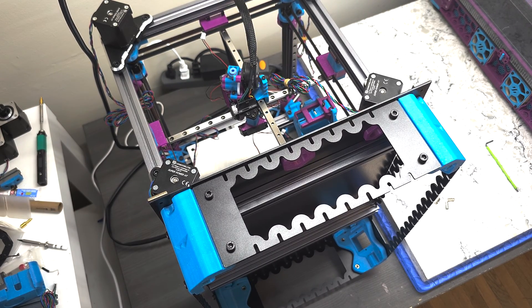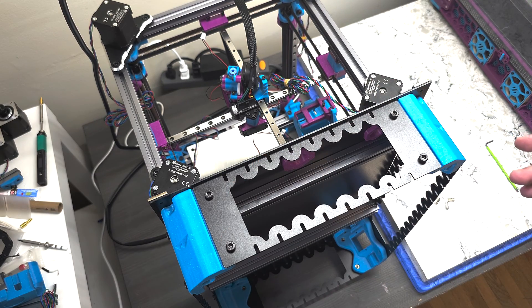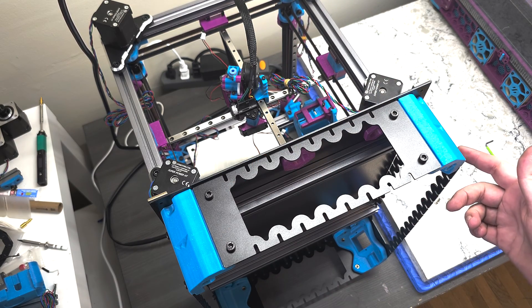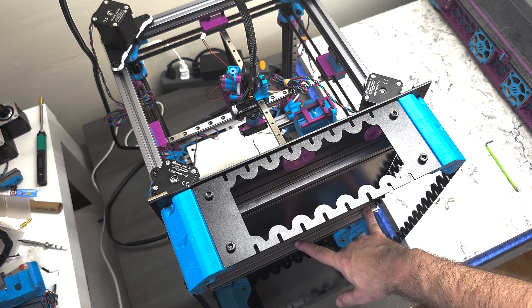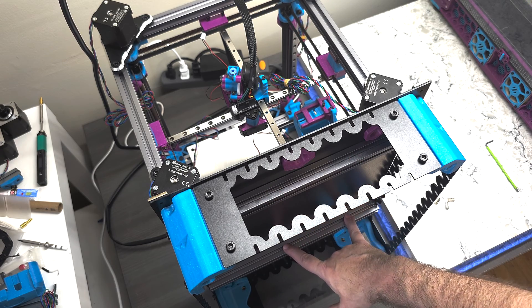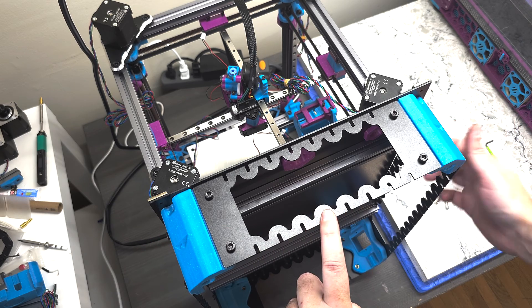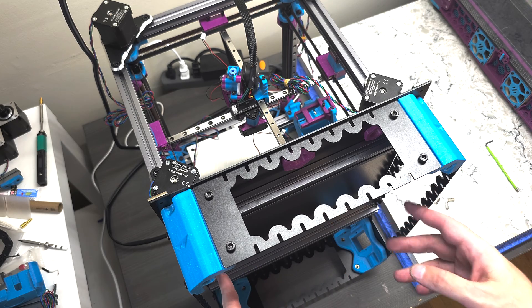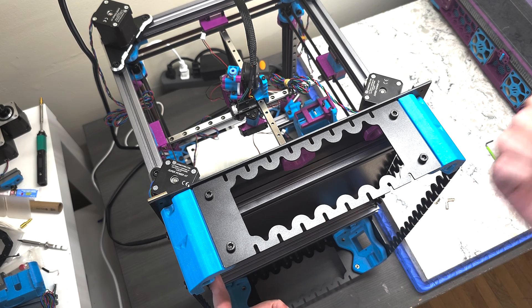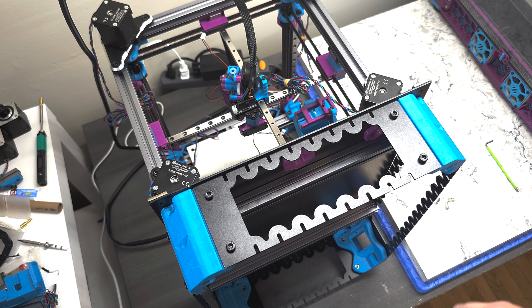So there is a little bit more to assemble for the backpack, but I've got the base frame of it done. There are a couple of problems I have to work on yet. It seems like these extrusions here might be just a couple of millimeters too long, and I might need to shave them down, because this plate on this side is bowed out because the extrusions are coming out past the plastic lip that this mates into.